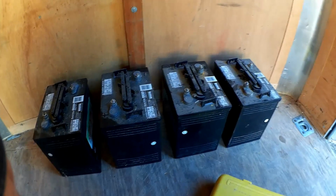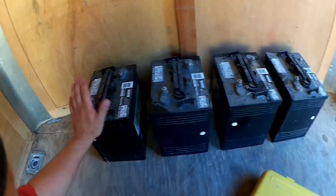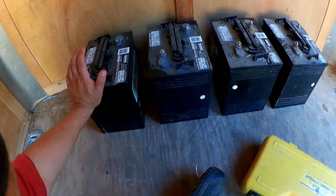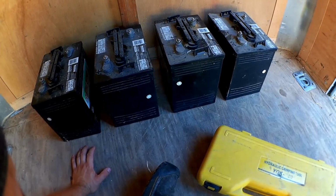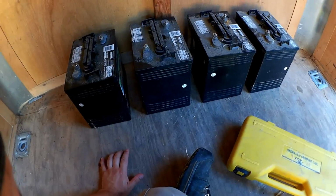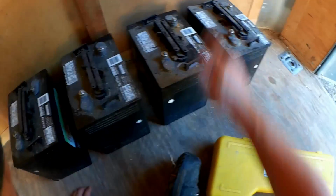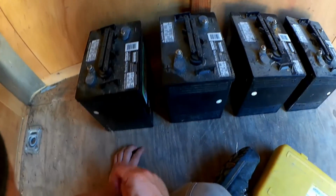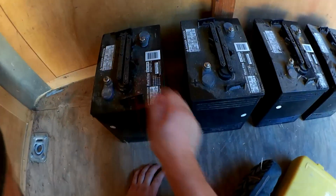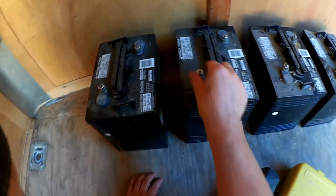So the important thing on a high-powered, low-voltage system like this is to have very good quality connections and very large and short conductors, as the potential for loss is great. Of course, you always want top-notch connections on anything you're doing, but on a low-voltage thing like this, it is the difference between working and not working. For connecting the batteries to each other in series here, I've had very good luck using scraps of copper pipe, like a half-inch soft copper, and flattening that in the vise, and then hammering it after that to make sure that it's very tightly flattened to avoid corrosion.